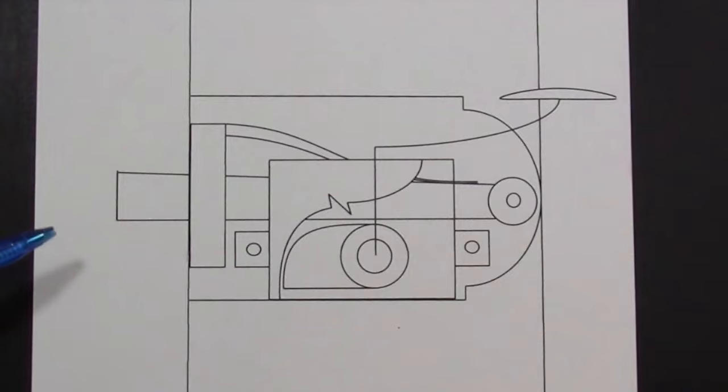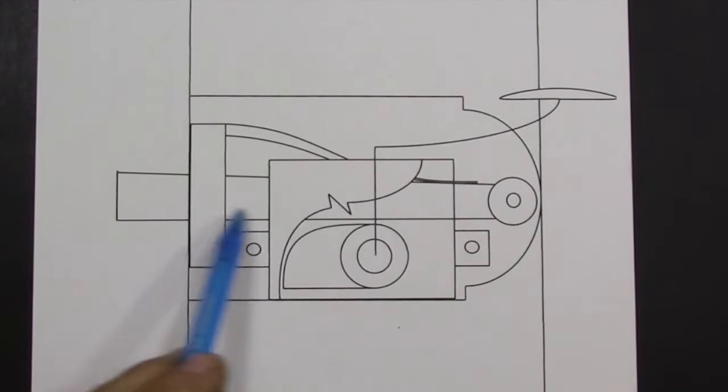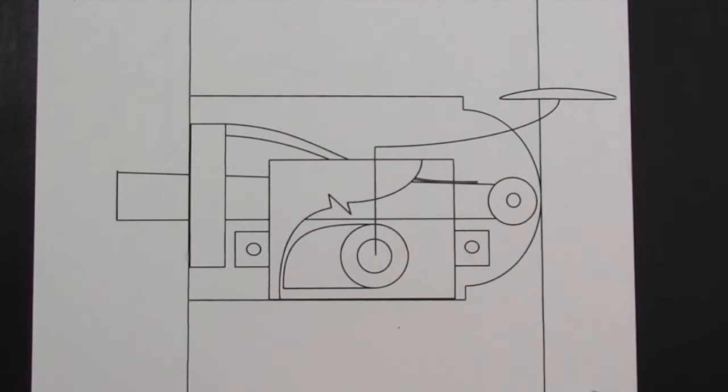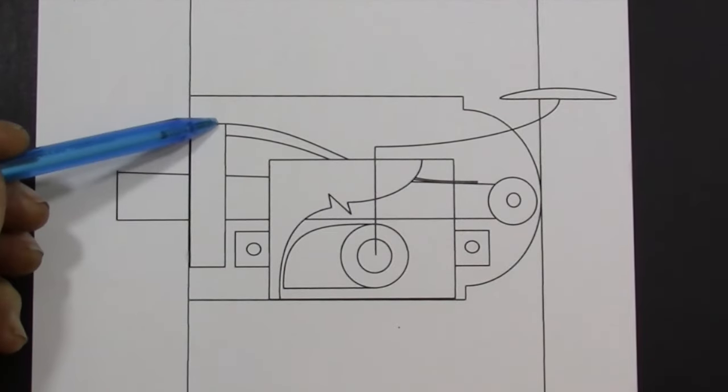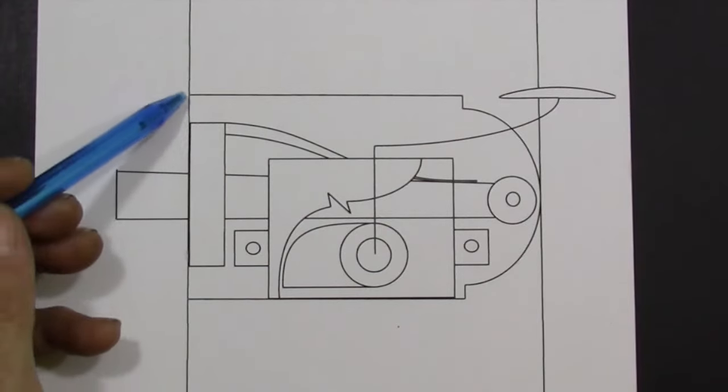As you can see, it's a pretty standard lever latch. This is the main latch bar that runs through the center of the latch. And this is the pivot point on the far right. I'll be using a pretty standard spring arrangement that you see on this type of latch. With this latch I'm going to be using a tumbler to lift the latch bar, and once again that has to conform to the hole that I have in the door, so that's predetermined.